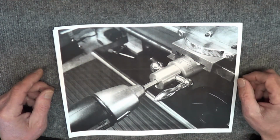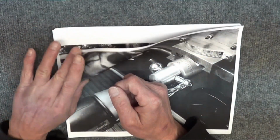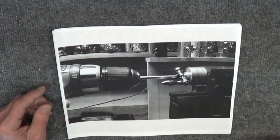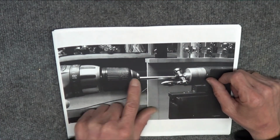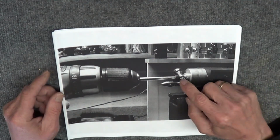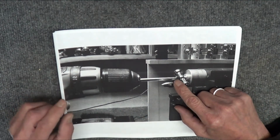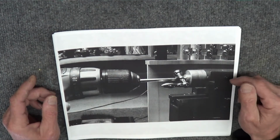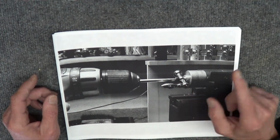Gets rid of all the different play. But I'm looking at it going, there's just an Allen here. Hey, why don't I try to do it the cheapo way rather than machining that? So I just sacrificed a spare Allen wrench, chucked it up and did it. But I learned real quick, if you're not straight, it starts binding in the socket head and starts jerking it around. The first bit of my test I was off, and then I finally got it nice and straight. And yes, gorgeous, gorgeous finish on it,